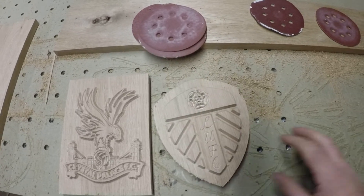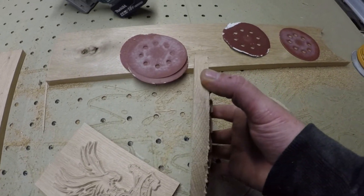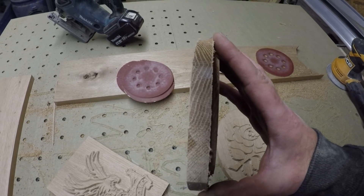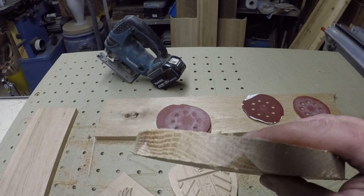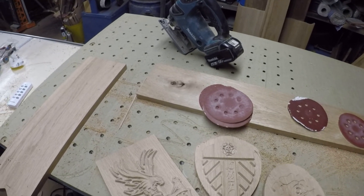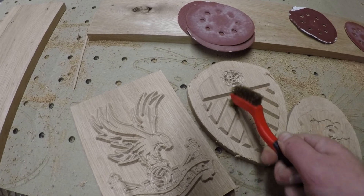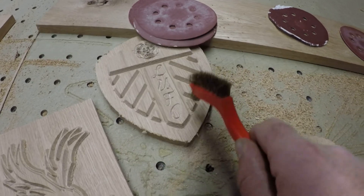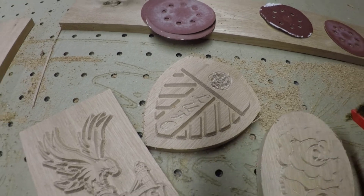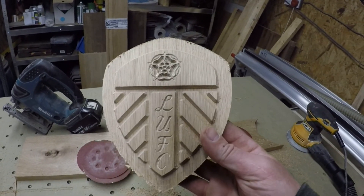Here are the three plaques off the SmartBench. I've given the surface a quick sand over with the orbital sander. You can possibly see the witness marks where I've cut the tabs off. I've gone round with the flush cutting bit in the router to take the tabs off, and I'll be going round now with a sander. I usually use a little wire brush to take all the internal fuzzies off - you can see the fuzzies come off relatively easily. A little bit of time and prep with the sander and they'll be ready for some clear lacquer to be sprayed.